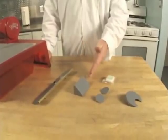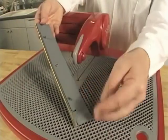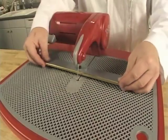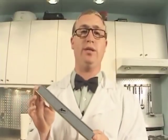Allow me to introduce you to our Taurus accessory kit. We have the straight edge, the 45-degree edger, two circle makers with double-sided tape, and the lamp wedge. The straight edge with its two pins can be mounted anywhere on the work surface and in any position. It also comes with a fine adjust for pinpoint accuracy. Although straight cuts are best accomplished with a glass cutter, there are many examples where the Taurus is useful: thin cuts in tile, difficult glass such as fused or rippled, trimming oversized pieces that are a thirty-second of an inch too wide, or simply for tiny thin cuts. In general, the straight edge can set you straight.